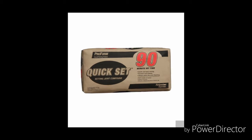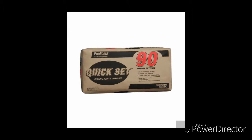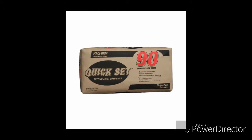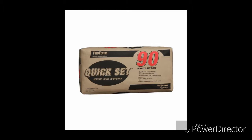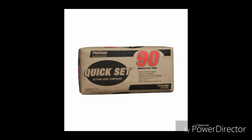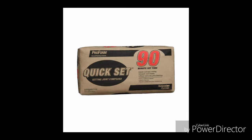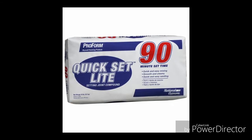This is a good product and in my opinion it's even better than Durabond — it's harder, it sticks better, and it flows smoother off the trowel. For those who actually finish with this stuff, there are people who will go over the material as it just starts to set and get a really smooth finish without sanding — a rare technique but some people can do it. Unfortunately, this product is very hard to find. I called National Gypsum and they said it hasn't been made in six months. I was lucky enough to find it at a Buckeye in Missouri — they had a pallet of it at about the same price as Durabond.